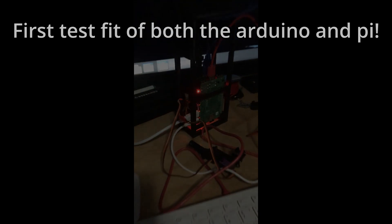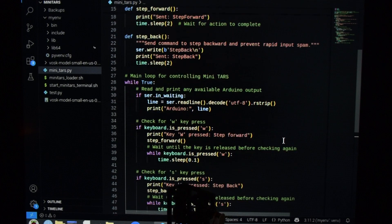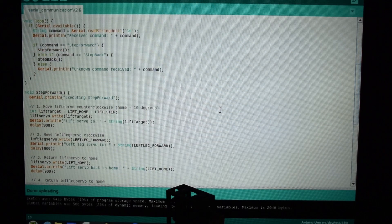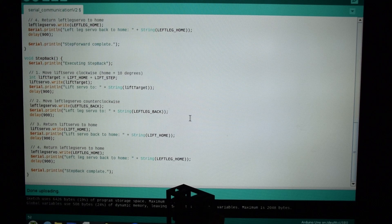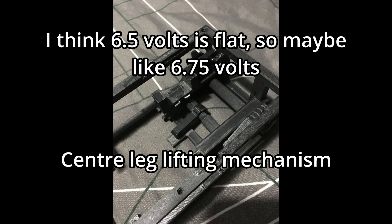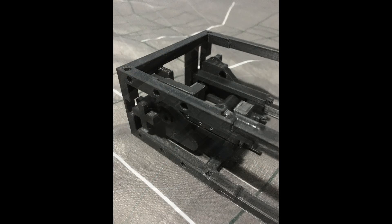After that I refined the Raspberry Pi and Arduino serial connection so they talk stably and can handle if one of them is not picked up straight away on boot. It's a two-way serial connection — the Arduino monitors battery voltage levels so it can send a command to the Raspberry Pi telling it the battery is only at 6.5 volts, on a 7.4 nominal voltage battery, and it can safely shut down the Mini TARS program on the Pi before the battery goes flat.